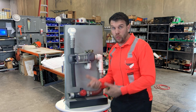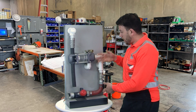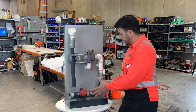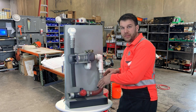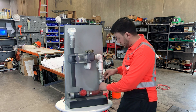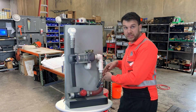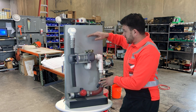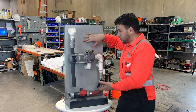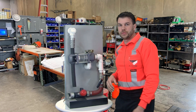Customers also complain about way too much abrasive. Positive differential pressure is created when there's a blockage somewhere in the piping, or your choke valve handle is loose or broken. In the field, there's no way to tell if the handle is loose or broken. What this does is put more pressure inside the vessel than what's able to go through your blast hose, creating positive differential pressure.